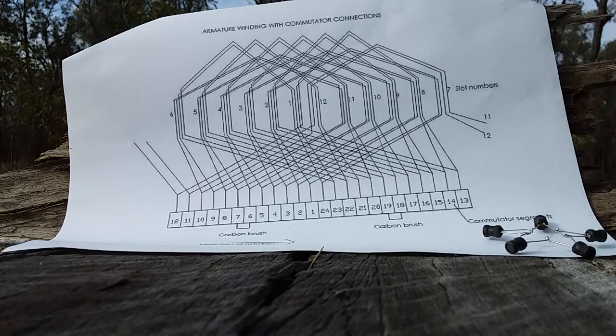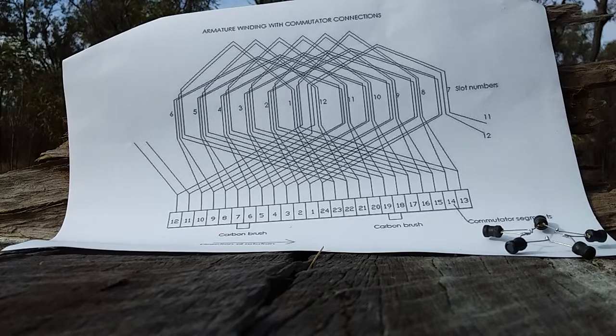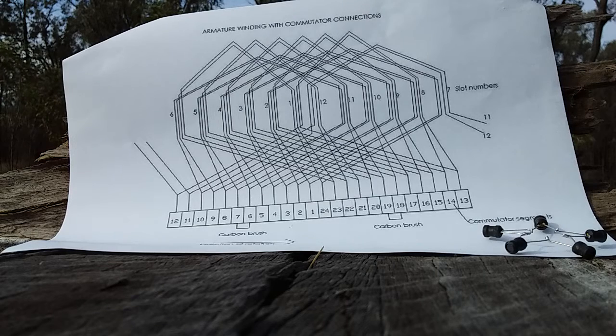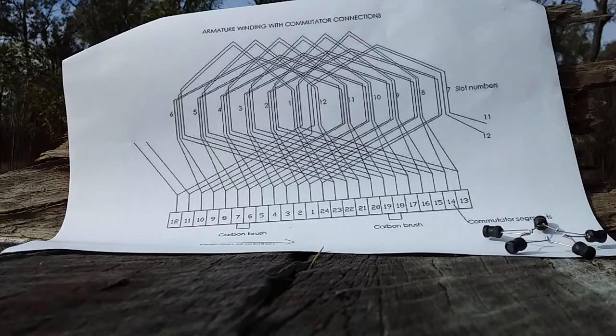There are far too many people out there blatantly stating facts incorrectly — saying something is a fact when it's not. The fact is, if you follow that diagram, there's definitely one coil that comes back to the other carbon brush, and possibly a second coil coming back through terminal six. On segment seven there's definitely one coil that comes back to 19, and on segment six you'll find another coil that comes back to 18. At any one time, there are two coils connected directly across the carbon brushes.